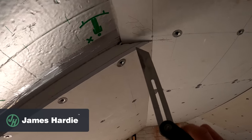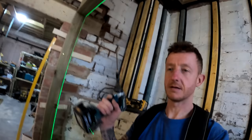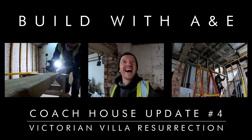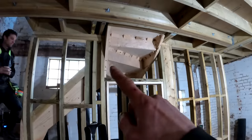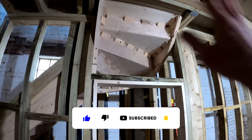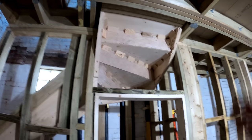So these are cut nicely at an angle rather than just putting up. The stud work is now completed down here. You can see that I've left a section out up here. The reason for that is because we're going to drop our four inch pipe down and across through here, so I don't want to stud any of this out yet until everything is in place. That way I can stud around it and make all the framework to basically disguise it in this bit of a bulkhead here.